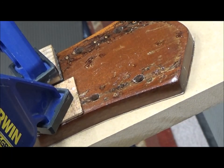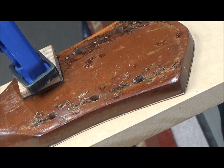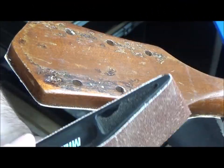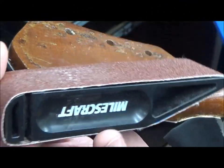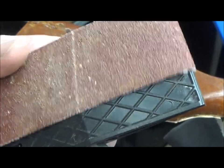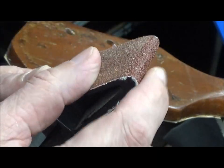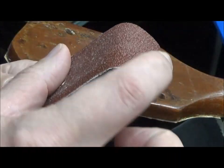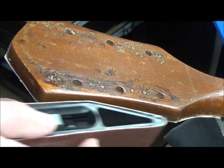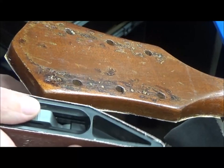So far so good — haven't torn off any pieces. Now that it's trimmed I can safely go at it with sandpaper. I like this little sanding thing — you can change the belt. There's 80 grit, and I can go to 120 after that. It's got all these different curved surfaces: a real tight corner, flat here, bigger corner, a sharp corner. Maybe this edge would work good to start with some 80 grit — though 80 grit might be too coarse.